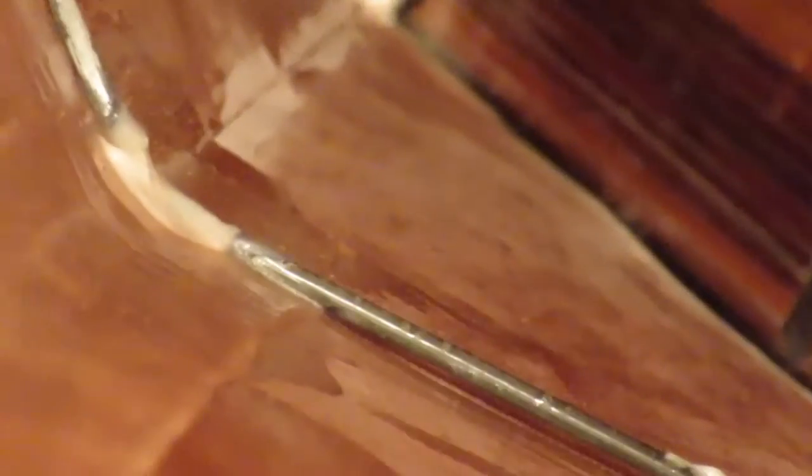We'll be mixing 6 large marks of clear epoxy with 6 small marks of hardener. And you can see we still haven't done the center line up there where we couldn't reach, and so we'll get to that as a separate step. We can't do those two together because we have to keep the boat positioned like this until the epoxy is set up enough along the edge in that groove, so the epoxy will stay in the groove and not go running across the hull or across the deck.